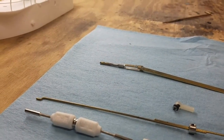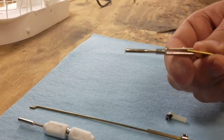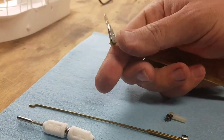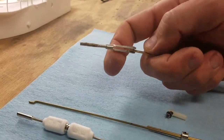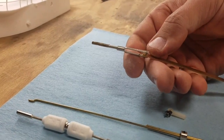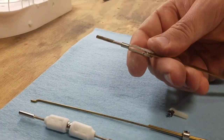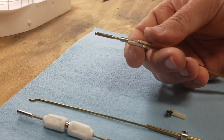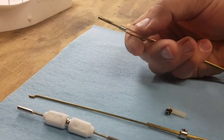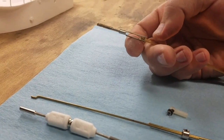There are a few traditional ways that you can go about this. The first one is sort of the tried and true linkage that you'll see a lot on RC airplanes. Basically you've got a retaining clip that goes through a hole in a linkage like that. Use these a lot when you want a very positive linkage that will never come undone. These are off the shelf and fairly easy to use. Good travel in a horizontal plane but none in the vertical plane, so that's certainly one option for you.